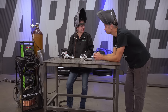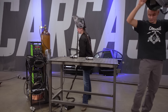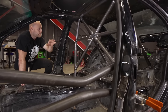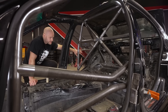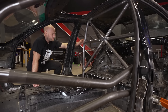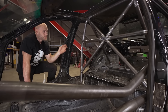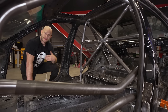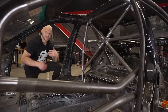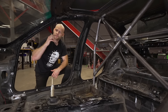I hope that you guys like it. If you have any questions, go ahead and give me a call. I've been making some great progress on the roll cage — I have the main hoop structure completely welded. I have some of the driver's side tubes in along with the rear down braces, and I also have the support plates for the main hoop and the rear braces fully welded in. I do have the plinth boxes for the front just tacked in for now. Something that's really nice to do if possible is to completely finish the main hoop structure outside of the car. What I did was once I fit up the main hoop, I fit up all the tubes and welded everything out on the table where I can be comfortable — weld everything, flip it over, do the other side — versus welding everything in the car where you have to contort your body. It's very time consuming and uncomfortable. So now I'm just going to mirror the driver's side over to the passenger side and get this thing finished up.